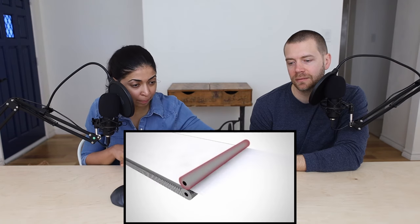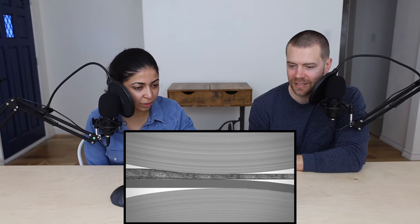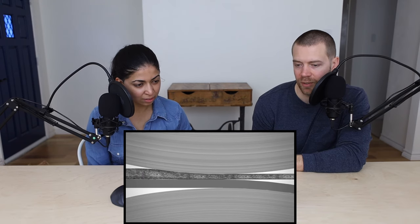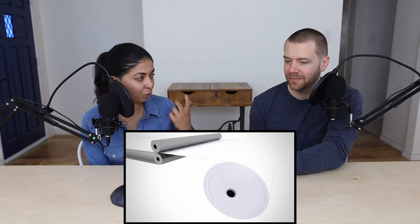It's not directional — you can see especially in this screenshot, it's very random. Several layers deep, all these microscopic fibers are random and then compressed and flattened out into a paper-thin form. It kind of reminds you of a sponge or spray foam or even OSB — all these particles coming together sandwiched in. Because the pattern is interwoven, there's not a continuous air gap from top to bottom. That sheet is then rolled out into the big Tyvek rolls you can buy.